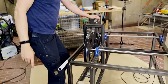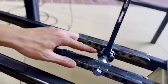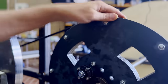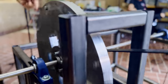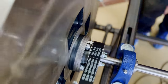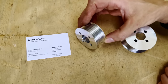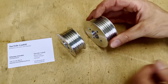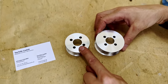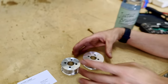Here we have the pedal — the power input. From the pedal there's a link going up to the pulley, and from the pulley we have a belt going down on the other side of the flywheel to a smaller pulley. These pulleys were made by a super nice machine shop called 2tele. I sent them only a 2D drawing and they machined these pulleys in different sizes.